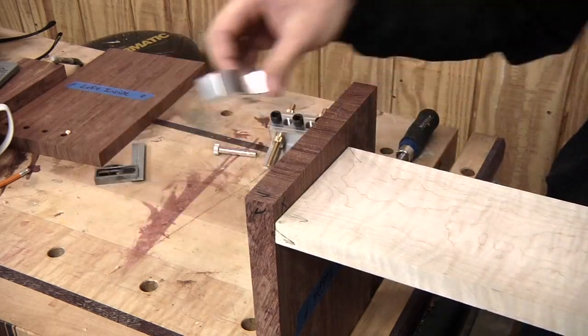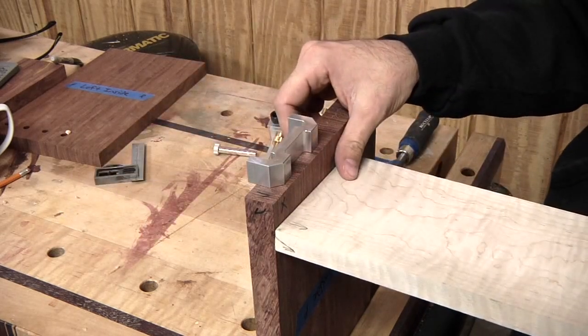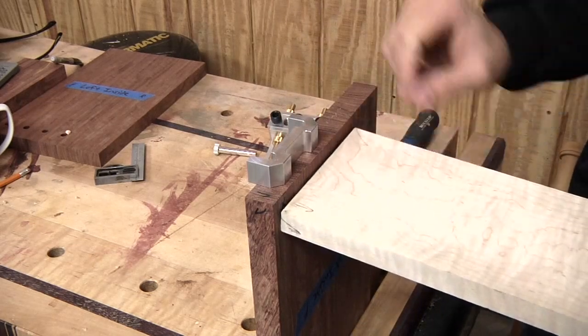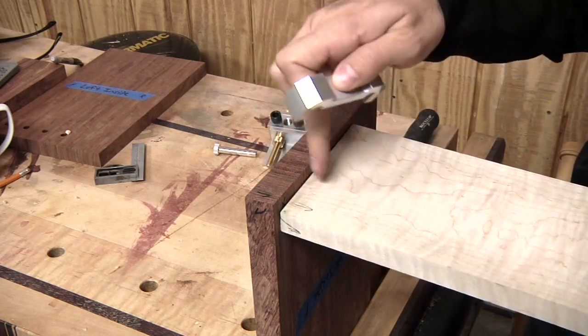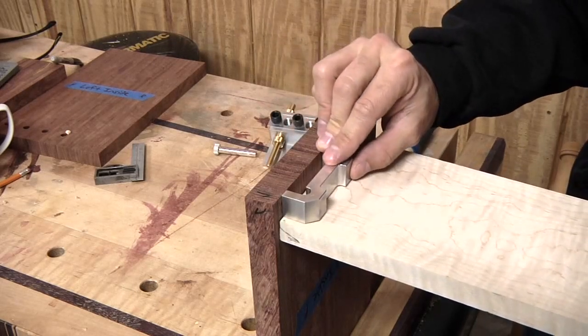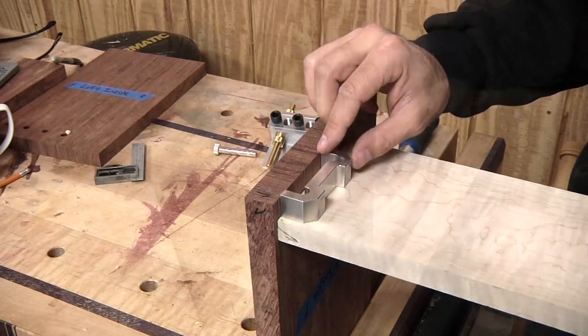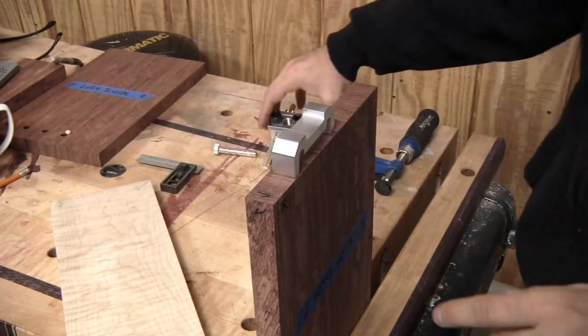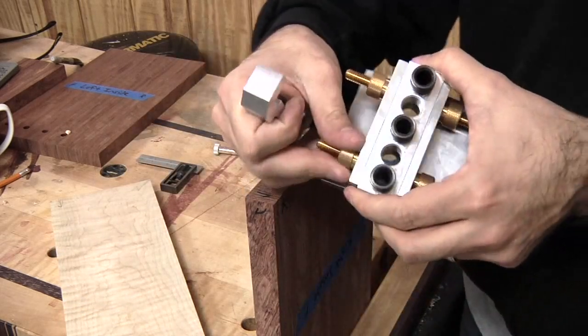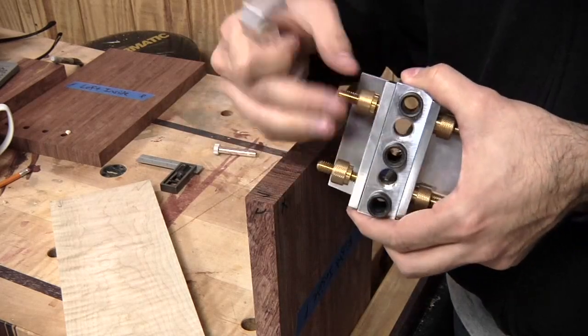Well, fortunately, the jig comes with little spacers, and this is where we had to measure at the front here to set this back. Well, we don't have to worry about that for the offset coming up from the bottom. We're going to use this little guy, and he's going to offset us about 3/4 inch. So to add this to the jig, it's very simple. That's what these knobs are here for. So just loosen those up,